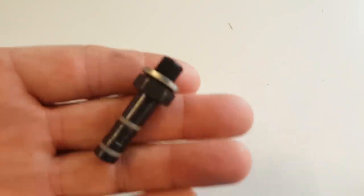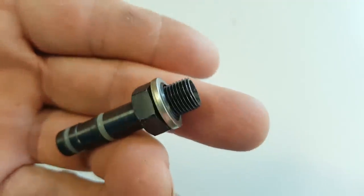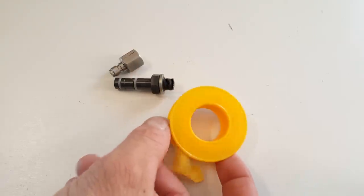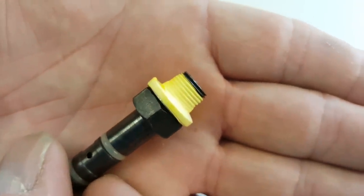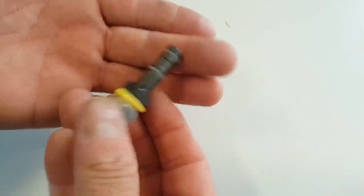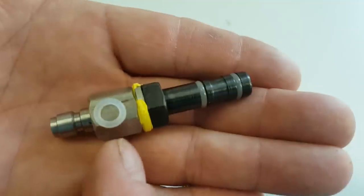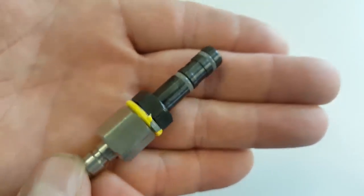One thing when you're putting Teflon tape around these fittings — you don't want to get any Teflon tape past the threads because it could end up inside your air gun, and you don't want any little slices of that in there. The yellow Teflon tape is actually made for gas, so it's a little better than the white stuff, though you can use white — the yellow is just a little thicker. Make sure there's no junk inside these fittings before you start, and keep everything clean so you don't get any dirt in your air gun.